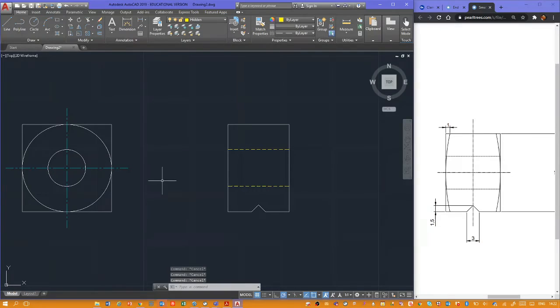What about this curve? We know it's one millimeter there. It's all about constructing points that you don't know. Then use the arc command — specify start point of arc at that intersection I just created. The next point of the arc needs to be the midpoint of this line, so Control and right-click and select midpoint, or type 'mid' and press Enter. The final point of the arc is back down to there. We're still on the hidden detail layer so let's place that back and move to there.